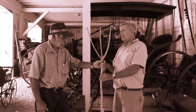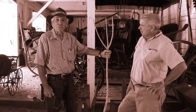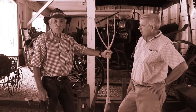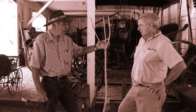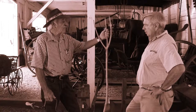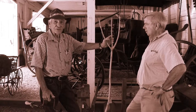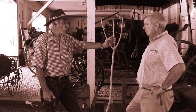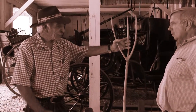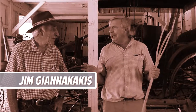It's a pitchfork — a rugged thing. That's the way the original settlers probably made them because they didn't have all the fancy equipment when they first came over. I had a difficult time finding a three-pronged tree, and it had to be hardwood — this is maple. After you find the tree, you make a form so you get the curve. You can make any curvature you want and any spread you want, because when it's green you can move it in any direction. Then you leave it in winter, take the form off, get a spoke shave and shave the back off, and you have a pitchfork.